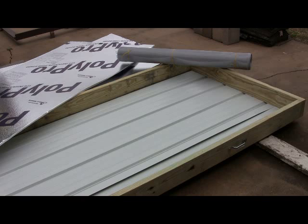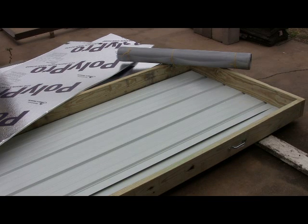We're going to layer the inside, and first we're going to put a sheet of aluminum with the shiny side hopefully towards the meter, and then we're going to put a layer of aluminum screen wire stapled inside. Then we'll put another layer of the aluminum 1/2-inch and another roll of aluminum screen wire. Now when you're at a distance, aluminum screen wire will just about block it almost 100%, but the closer you are to the source, it's very hard to block this radiation.